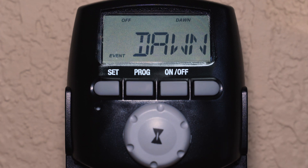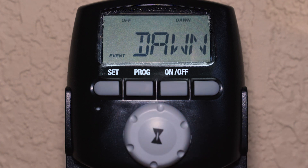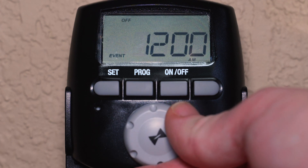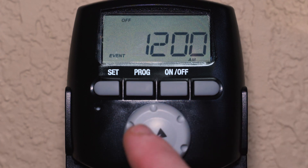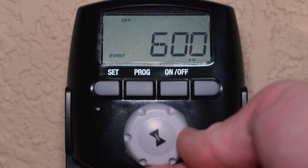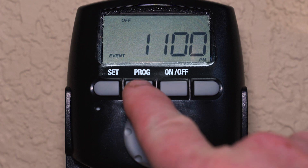As you can see, the timer is set to turn OFF at dawn, as determined by the offset applied during setup. For this example, we would like to change this setting so that the lights turn OFF at 11 PM. Press Program and the indicators flash, allowing changes to be made. Turn the dial until you see a time format displayed on the screen. Press Program again and the hour flashes, allowing changes to be made. Turn the dial to get to the hour you would like — in this case 11 PM — and press Program to confirm.